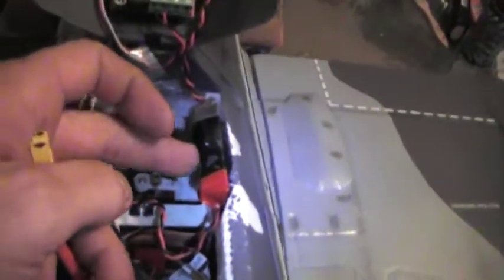The voltage regulator card I mounted here on a piece of Velcro, and you'll see the wires traveling up here — my JST connector split between it and the amplifier — and my amplifier is mounted on the lid. Now I can keep the amplifier far away from all the electronics, which, if you get close to electronics, can cause noise in your system. This gives you the better choice of being able to move it wherever you want to isolate it, just like you would a BEC or anything else.